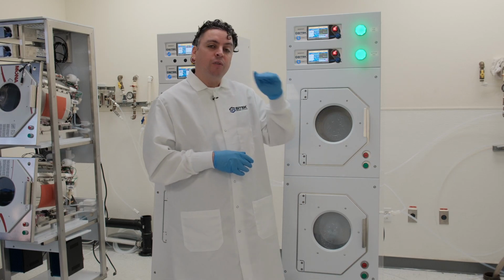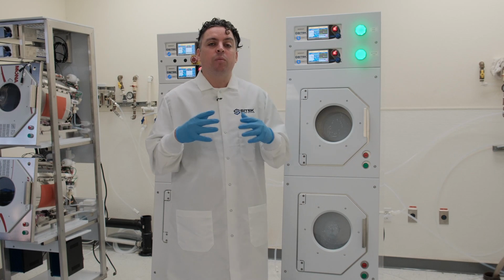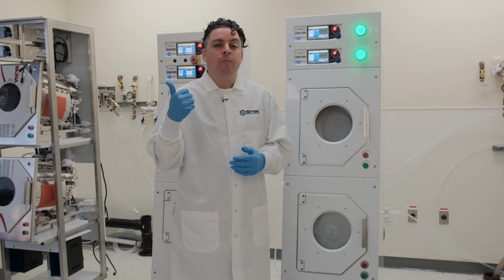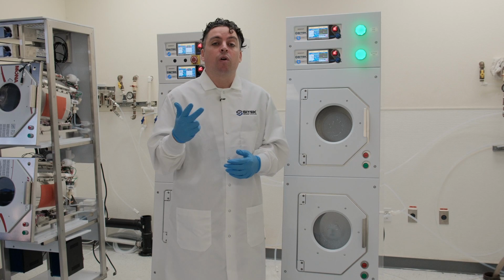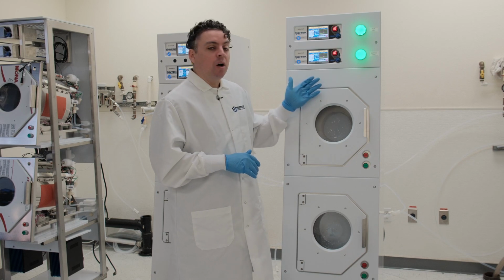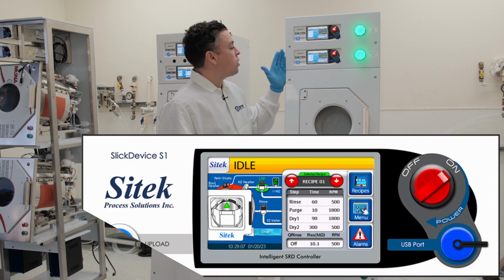We're going to ramp down to 500 RPM and stay there for about 5 minutes. We're then going to let the heating elements of the system continue to finish the dry, which will give us the best results out of the system for a short process time, as well as minimal particles added and a uniformly dried substrate surface.